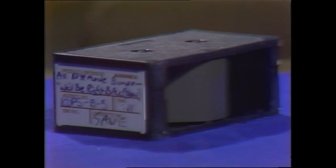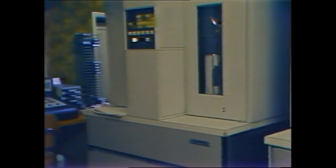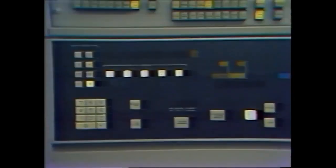In addition to the two reel-to-reel recorders, we also have a two-inch video cart recorder player. The advantage of the cartridge is its ease of operation. The tape is contained in this box-like cassette. Once inserted into the machine, it can be played, rewound, and cued for another playback at the touch of a button. Up to 24 carts can be loaded at one time, and with two recording playback units, they can be played in any order with virtually no dead air in between. With a lock-up time of 200 milliseconds, the start of the tape and playback is almost instantaneous. And with the automatic sequence computer, eight commercial breaks of up to five spots each can be programmed in advance. This makes running the board and airing of commercials much easier and much cleaner.